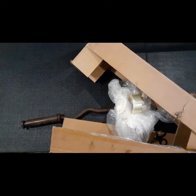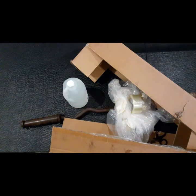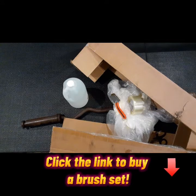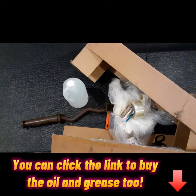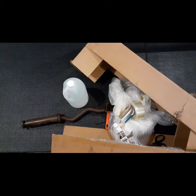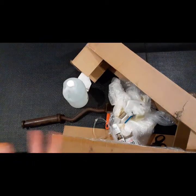Let's not forget what goes in the box: a water source and vinegar — a big jug of it. Then you'll bring it out, dry it off, and use a brass brush. After the brass brush, use a nylon brush and some three-in-one oil for rust protection. It's also a good idea to use some Teflon grease on the sleeves. And keep in mind your safety — do this in a well-ventilated area, wear a mask, safety glasses, and gloves.